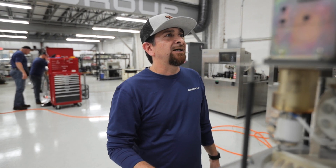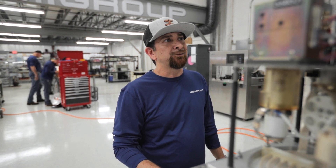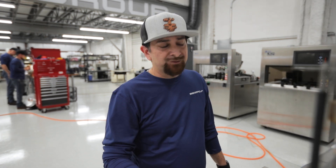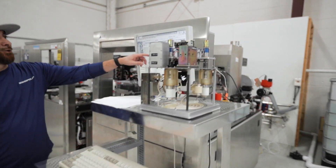So I'll turn on my nitrogen at 350 sccm and control pressure at 1100 millitorr. And I'll ask for a set point of 1000 watts RF. And it's tuning.